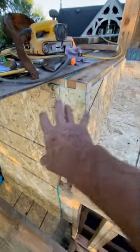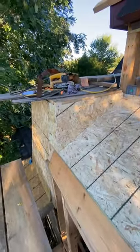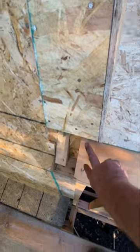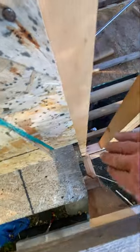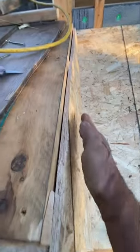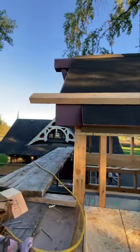I finished tying in this side of the tapered tower, so we now have that completely surrounded. And so this corner detail will terminate here, the gutter will come past here, and the crown terminate inside of here. So the gutter will go to here because that wall, if you can see, is the wall section. The little base here will continue around and terminate into the wall. All of those details have to be considered. And of course, now you can see that that taper is going to clear this little corner of the roof.